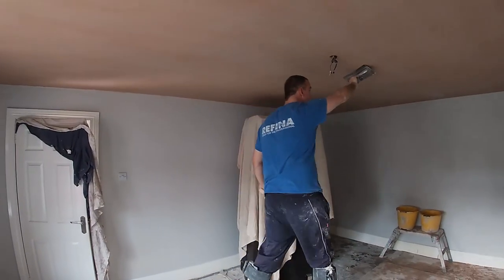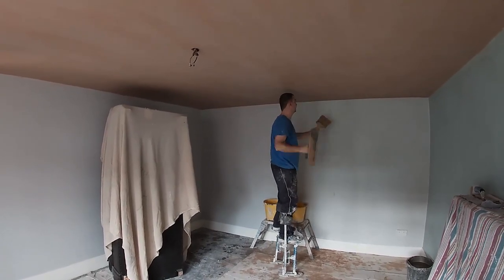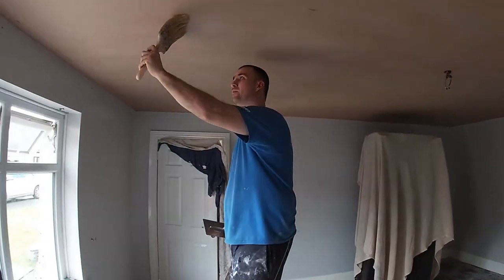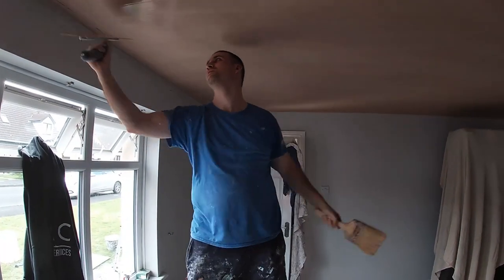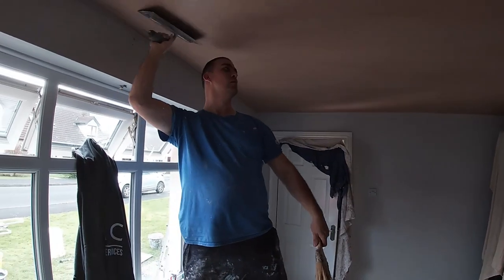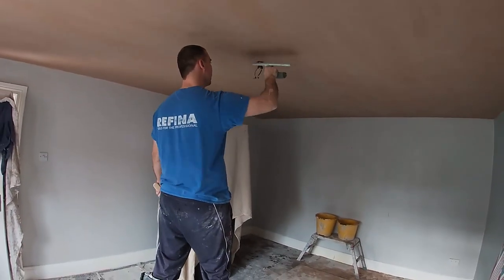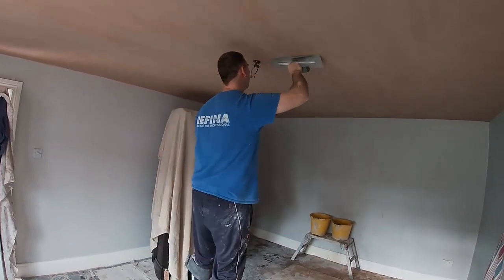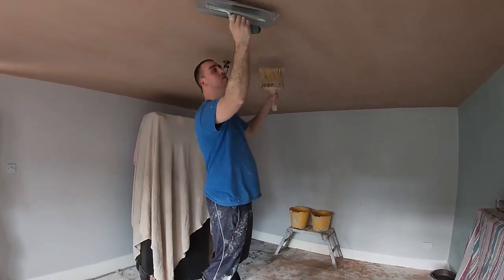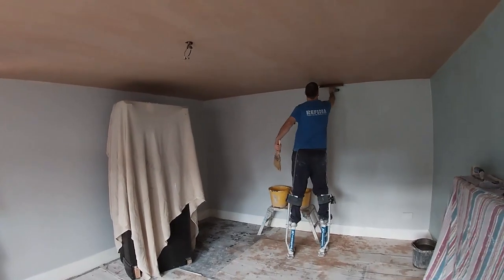The ceiling has only started speckling brown at this stage so it's not gone very tight just yet, but it's definitely on the verge where the flexi trowels save the muscles, save the shoulder, save the joints a good bit. I've been recently doing lots of sand-cement work, lots of rendering, and flexi trowels — I wouldn't even try a flexi trowel coating that stuff — but basically what I'm saying is when you're doing that kind of work, if you can get a wee bit easier when you're skimming, definitely get your hands on a flexi trowel.